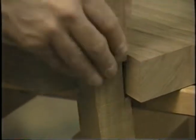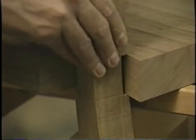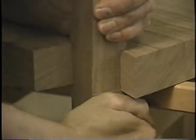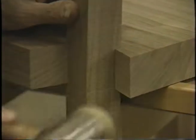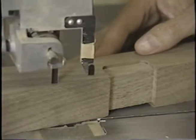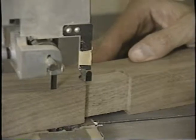The back legs are easier on this chair. I've notched both the front and inside face of the leg. The 2 notches add up to a very stable joint. When the joinery is done, we can get on with finishing the shaping. On the legs, this means bandsawing a curve into the notched side and then smoothing.